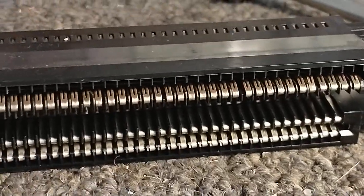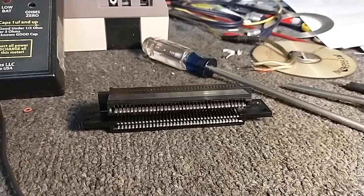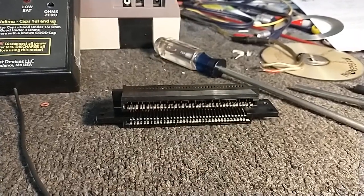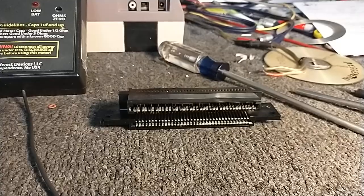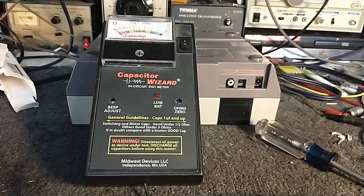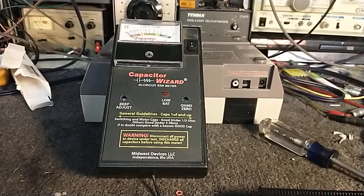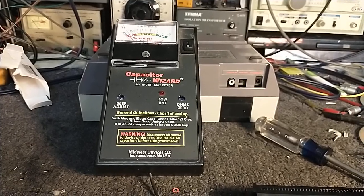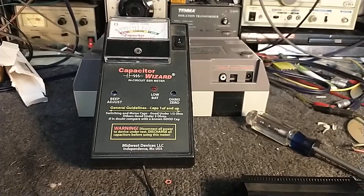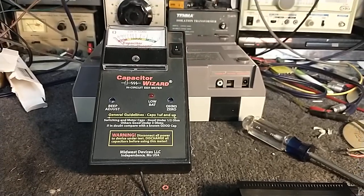You still have a conductor there — it's still a piece of metal, it still conducts electricity — but the consistency of that conductivity has been damaged by the fact that there's no shiny contact plating material in it. To illustrate this, I've got my capacitor wizard, which is an ESR meter that transmits a very high frequency, very low current, and it really reveals failures in connectivity. Let me get the camera mounted and I'll show you what I mean by touching between the plated and non-plated material.